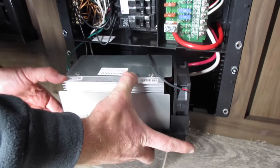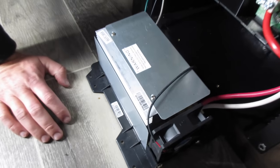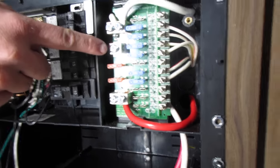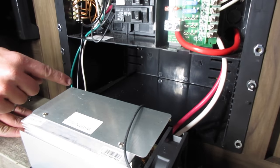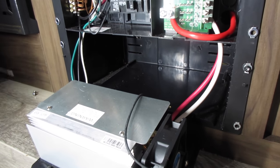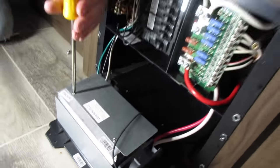Now I am NOT plugged in and my batteries are disconnected. So this is your power converter, and the problem I was having — this is your power wire going back up into your system. There was power coming into this from this side, but nothing getting to this side to actually convert it to DC power, where AC is your normal house power.